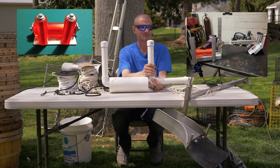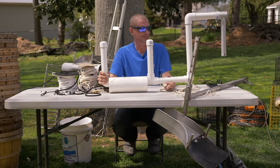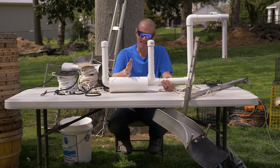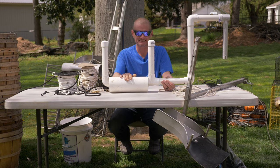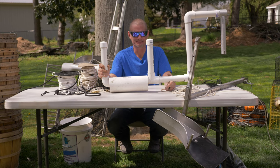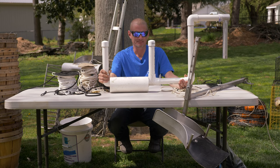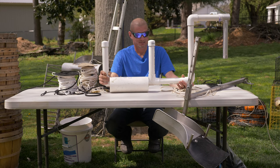I've also seen nylon trailer-style rollers that people use — Captain Bruce sells something like that. There are all sorts of options. If I can find the picture, my buddy Captain Claus bought one made out of threaded pipe — gas pipe — full solid metal piping. One downside: it's cheap, but as the line rides it, it slowly wears grooves over time. I'd say if you get out a decent amount — 10 to 15 times a year minimum — you'll more than likely want to replace it every year.